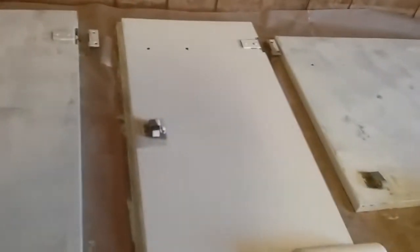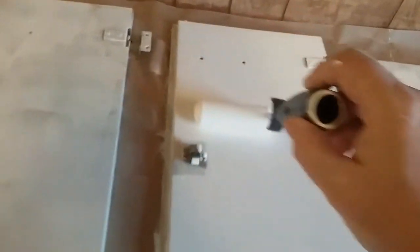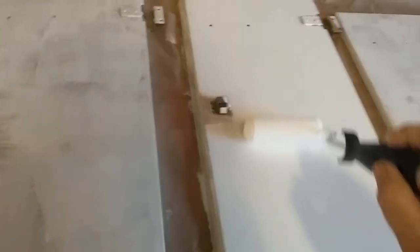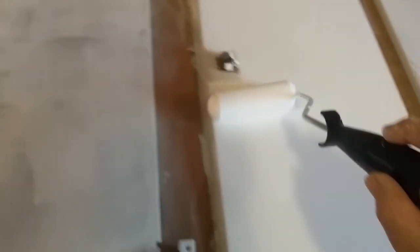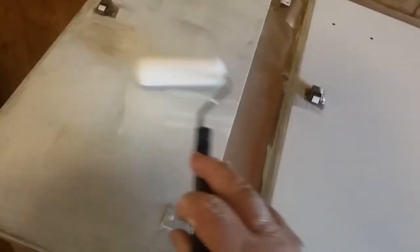Put your paint on and after it's set — now this is leveling paint — just go and lightly, just the weight of the roller. This is knocking down the air bubbles, any roller strokes, anything like that. I had one coat of primer. This is primed over here, and this is primed, this is fixing. Then I'll put two coats — even on the backs — of this high gloss ultra white paint. The ones I've done already are turning out really nice and smooth. Sometimes you get crud in there — that's why I hate rolling.